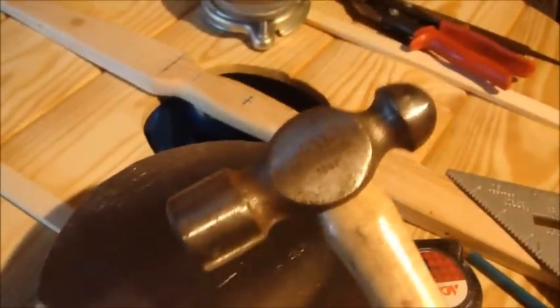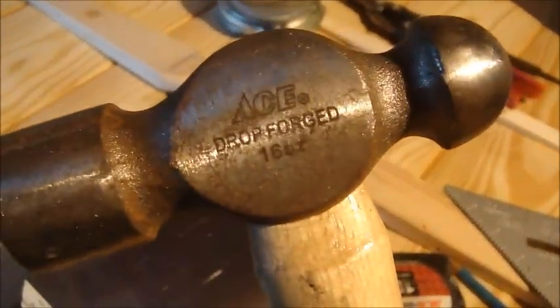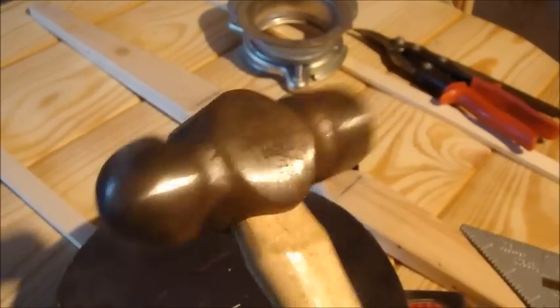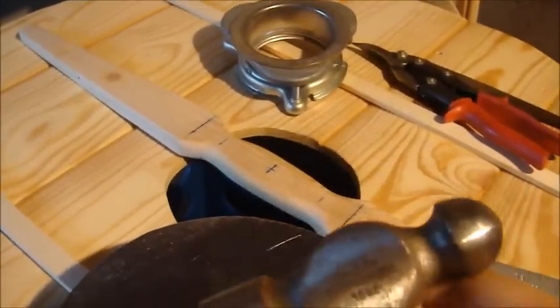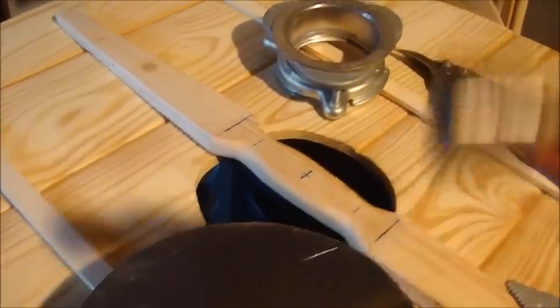As far as dishing goes, we just have the aluminum and you're going to put it on top of the void. We're going to use a ball peen hammer of a regular size — not too tiny. This is a 16-ounce that I just bought at the hardware store. It's a peen hammer because it doesn't have a claw on the back. Because of the round edge you can make the rounding and dishing a little bit easier, but you can also use the front side.